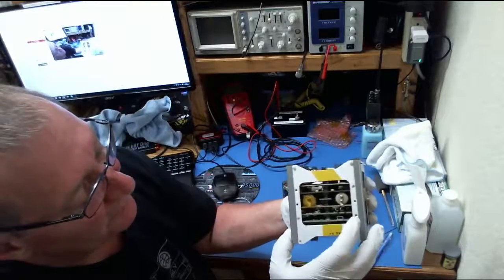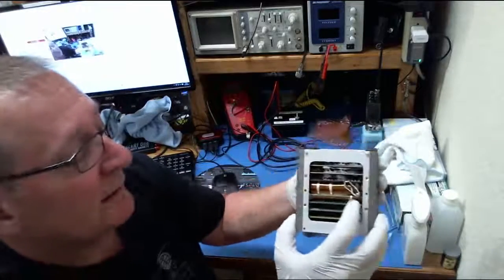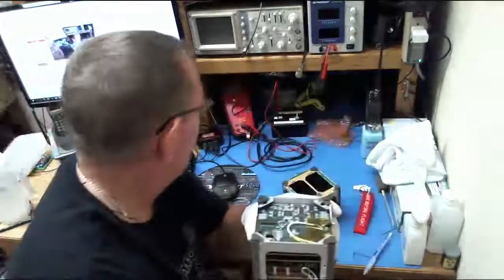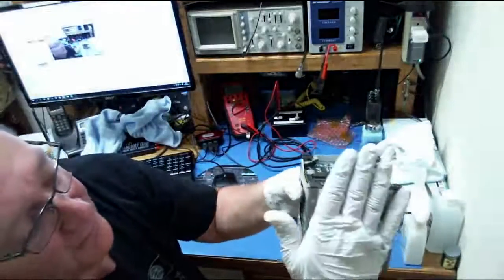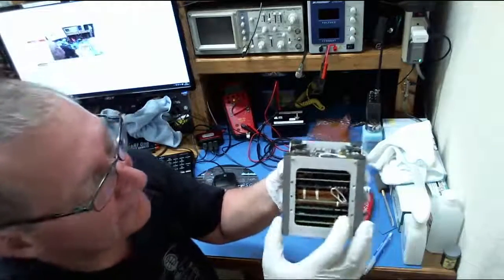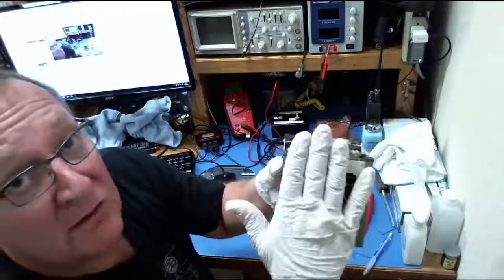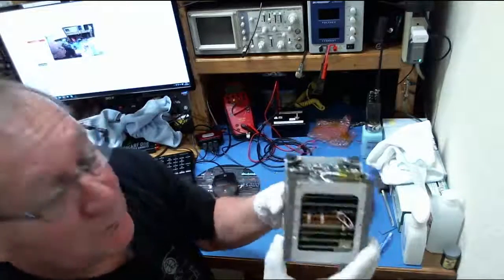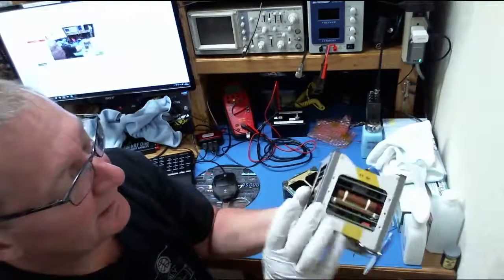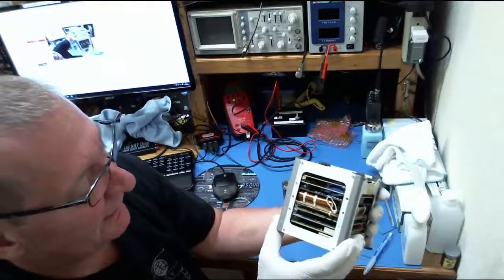Below the battery board is the power supply. This is one of our new MPPT, Maximum Power Point Tracker. You can see a little connector on the edge here. That is where, and I don't have one handy, but the solar panel, when it is attached, it has a connector on the inside, an MEC connector by Samtec, that fits right over those pins, and that's how the solar panel makes contact with the bus of the satellite to provide the solar power, temperature, and also for the antenna deploys. There are extra connections there for the antenna sensor and antenna deploy.